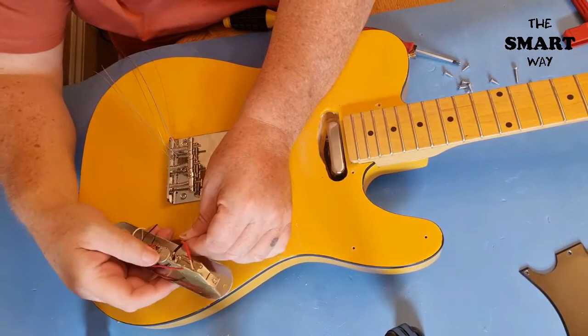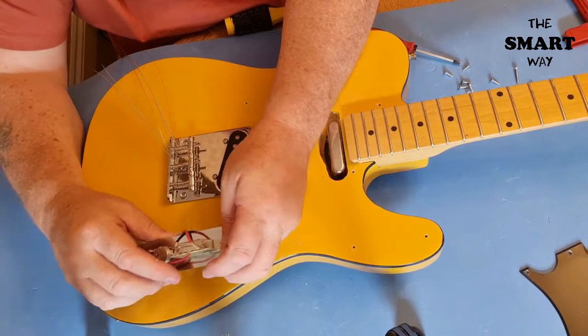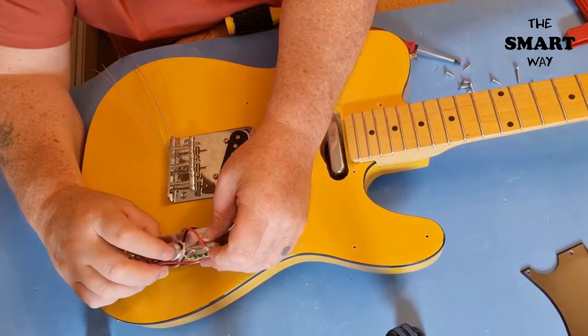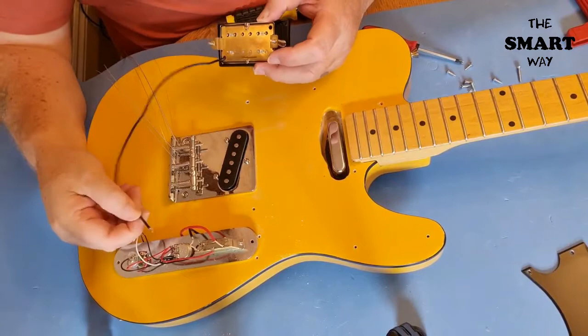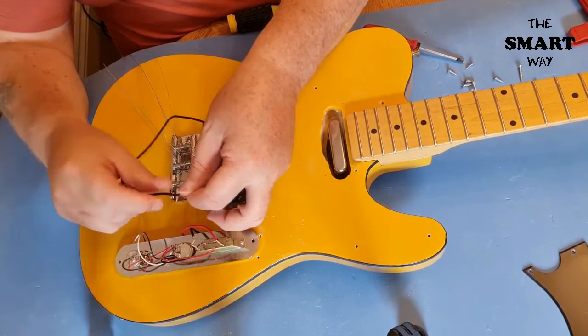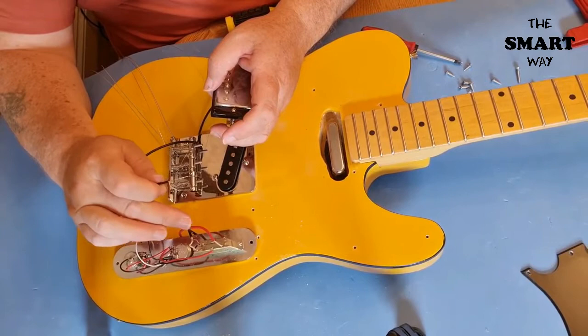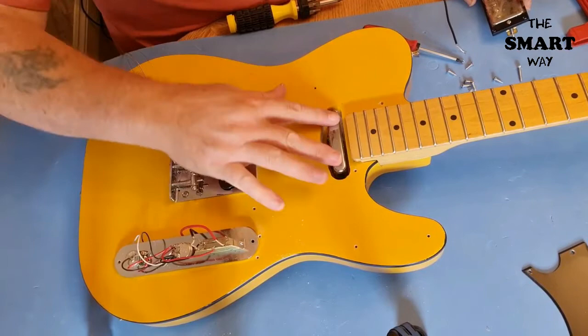Here's the pickup — it's this black wire here. You need to carefully look at where that's soldered. There's a circuit board there, which is surprising — it's a switch but it's a cheap switch. The earth just goes on to the braiding, soldered to this piece of the board. The new pickup will have similar wiring — the braiding solders onto here and the white wire onto there. A tip: take a photo of the switch so you know exactly where the wires go.